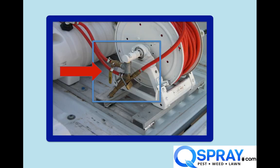Here's another example. This is as elaborate as I've ever seen. You can see in the center here, not only do they have a bunch of plumbing coming off the swivel, including a ball valve to turn the agitation off and on — and every time you turn that valve, you're going to reduce the life of those swivels — but there's tons of stuff hanging off here. They've got plumbing, they've got the spray gun locked on here. This just seems like a problem. You hit a couple of good bumps and who knows what kind of damage you're going to do. There's just too much stuff hanging off of this thing.